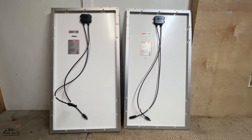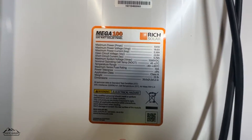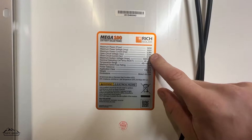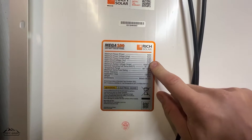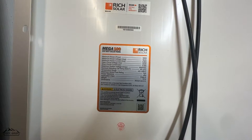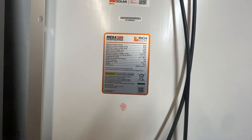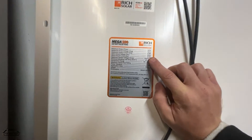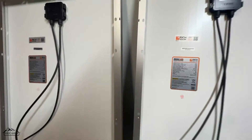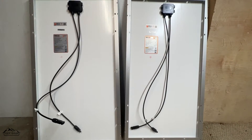In the series video we talked about how — and I always suggest using the same solar panels — you're going to see there is a Vmp and a Voc, which is the highest voltage that will come out, the open circuit voltage. There's also a short circuit current, the Isc. In series connections we add together the voltages. In parallel, voltages stay the same but short circuit currents add together. So here we have 5.78 amps, and when you connect these two panels together it's going to be about 11.4 amps total.